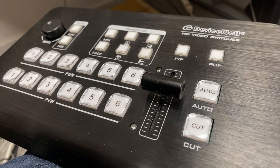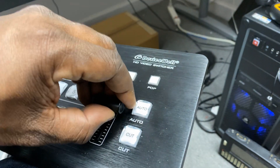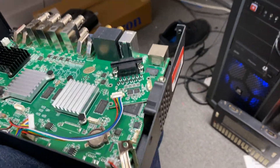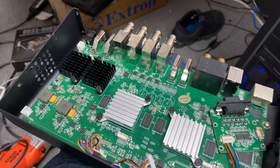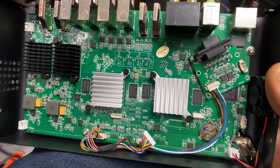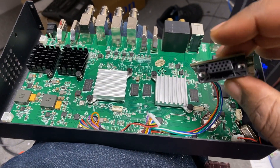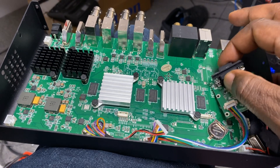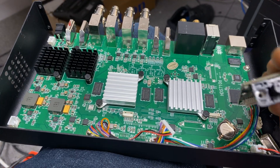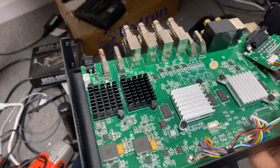So here's what I decided to do about it. I took this thing apart so we can see inside. Inside are what I'm guessing are four processors. Two of them are most likely field-programmable gate arrays, either from Altera or Xilinx — most likely Xilinx. This pigtail here is for the Tally; you can do RS-232 off this too. It has a little Panasonic battery to keep your settings stored. But here is the Chief Offender.